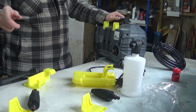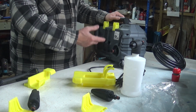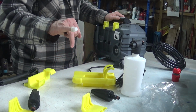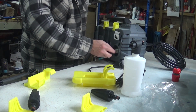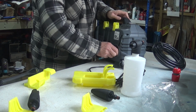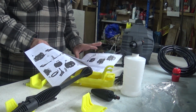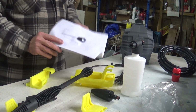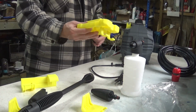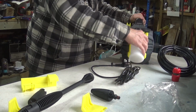Right, so that's that. In the manual it says that you've got to screw this on, and it's got a sieve connector in it, and put in a sieve first. In actual fact, this was already on, and the sieve, which is that little thing there, was already in, and that's obviously just to stop large lumps getting through into the pump. So now I'm going to screw that back on and do it up tight. So that's a couple of bits to be wary of. There is a nozzle cleaner, which as it happens is referred to in the manual and is actually there, and that will have a home on that in a minute. So we're now going to go and plug all these plastic bits in. This is the big bit. There's 4 bits of plastic in that little bag. That slides on there like that, and that holds that.